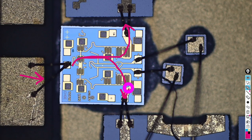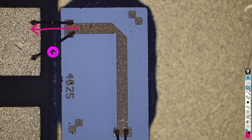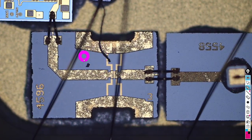So the signal goes either up or down, and we know this because we know there is a front-end switch. This was working because we were getting the sub-10 GHz signals to function. When the signal goes up, it just goes through the ceramic transition and then back out — those are the signals up to 10 GHz, which were all working fine. It basically loops around. All these devices are made by Agilent and then Keysight of course. Now going the other way, the very first thing we see is an attenuator. This helps matching between devices and conditions the signal more favorably in terms of return losses and standing wave ratios — maybe a 2 or 3 dB attenuator.